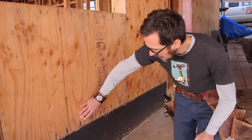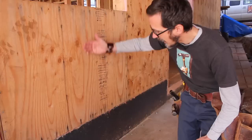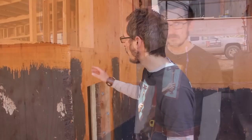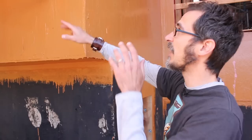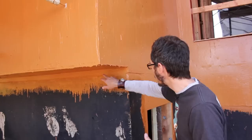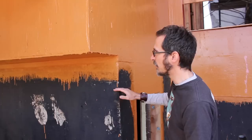We'll have a couple shots of how we treated this on the face. After we bedded the plywood in joint and seam filler, we come back on the face and do a swath of joint and seam filler, then run the Cat5 all the way down about four inches below the top of the stem wall — completely air-sealed. We have a lot going on in this one corner: a big long cantilever, a pipe penetration, scaffolding connected to our plywood, and a window opening.